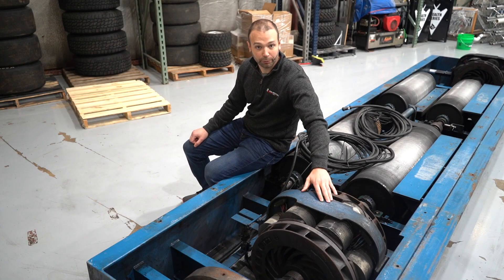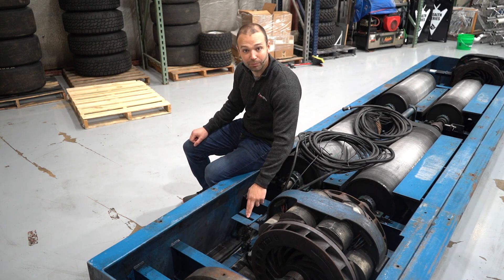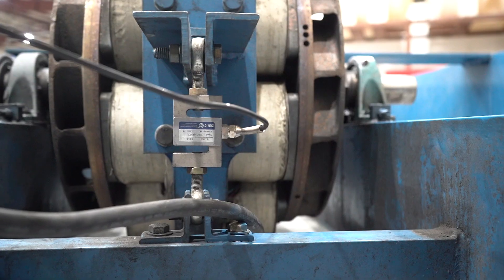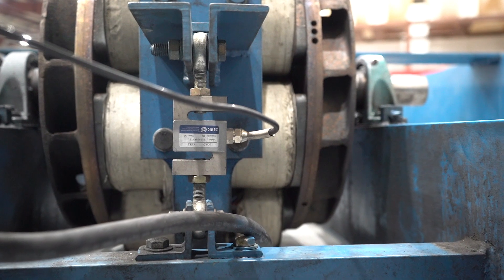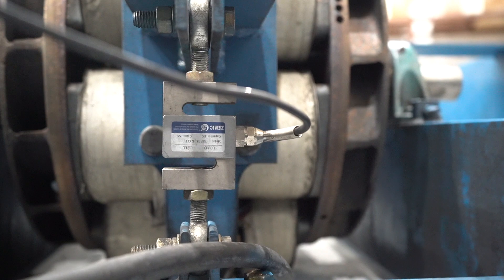This is the brake on the rear. This brake is connected to a torque arm, and as that brake absorbs energy it creates a load on this arm. That force or load is measured by the strain gauge, which picks up torque. We have speed and now we have torque — we can put those two things together and measure horsepower.